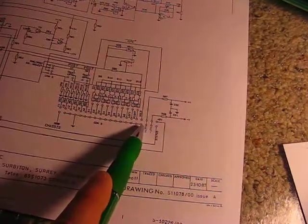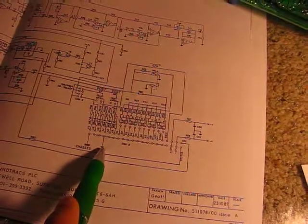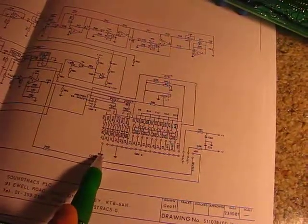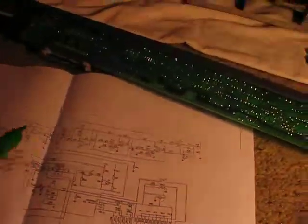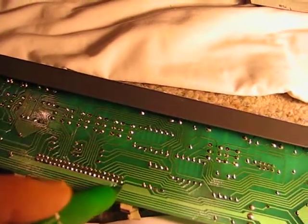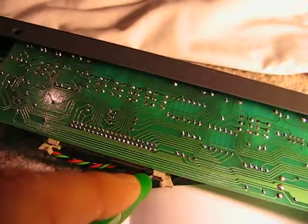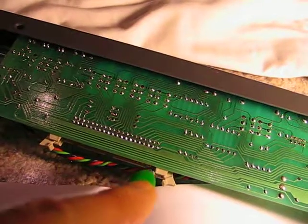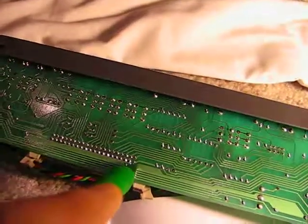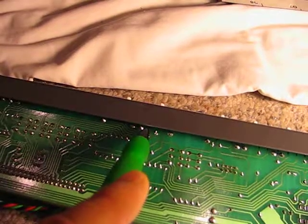And when we look at our input PCB schematic, okay, so here's our 40 pin connector. And looky here, here's all those contacts that are referenced to the system ground. And you get this one over here that says chassis. Well, I'm not sure exactly what, well, okay, no wait, I do. This will make more sense later, but this one is all by itself here and goes to, I think that'd be pin 20. At any rate, we follow that. It goes to a 0 ohm jumper up to here, on up to here.